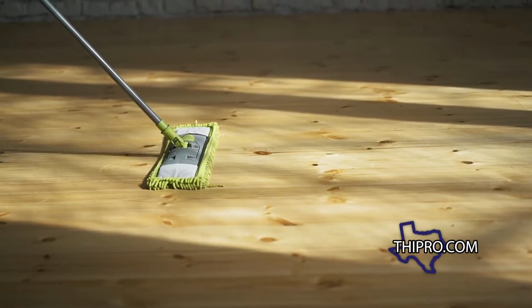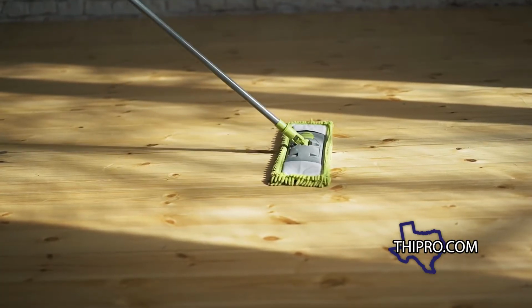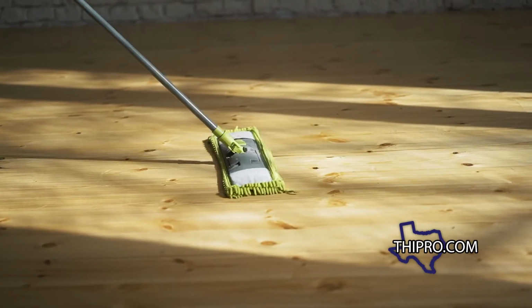Thank you, Monica. Well, it depends on how long ago the wood started buckling. Quite frankly, people think just because the wood floor got wet, it's instantly trash. And even if it buckles when it first gets wet, if it's properly dried out after being wet that way, a lot of times it'll lay back down and be just fine. But time is of the essence. You've got to get this process started immediately and get any water off that you can get off, so this isn't a problem.